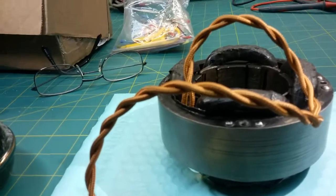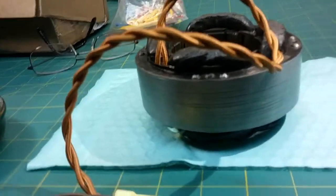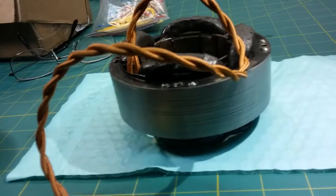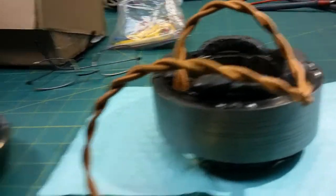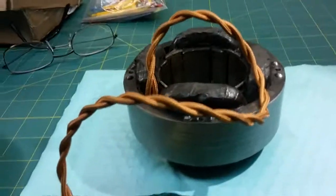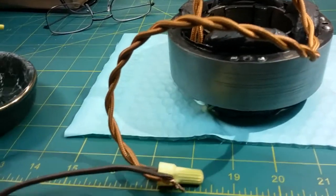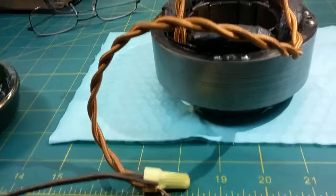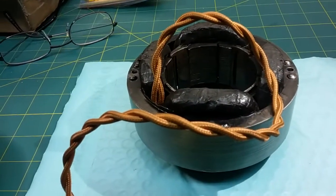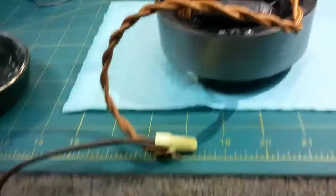You shouldn't be drawing an amp at 50 volts. The other thing is making sure that it is switching — that there's a magnetic field in there for the armature to turn. That's all you can do to check the stator. Very simple. But that tells you that the stator's working and it is functioning correctly. And that's how you know when you don't even have the motor — you're just checking this stator for functionality.